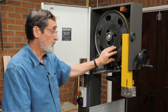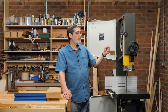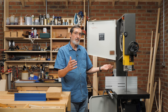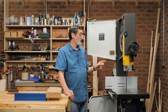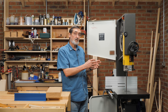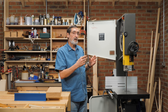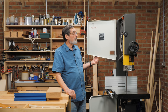To carry the cast iron wheel with the kind of tension I need on the blade, the frame of the bandsaw must be strong enough to resist the pressure — 2,000 to 2,500 pounds of pressure on a wide blade. That's a lot of pressure. So what I'm looking for is heavy gauge steel or a cast iron frame. In this case it's a box structure — very rigid, very strong, more than equal to the task of the pressure I might apply.